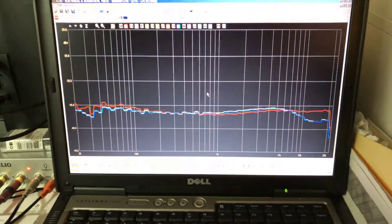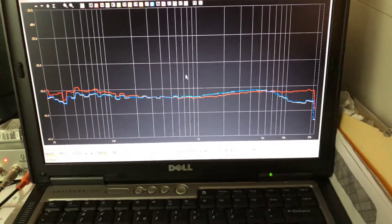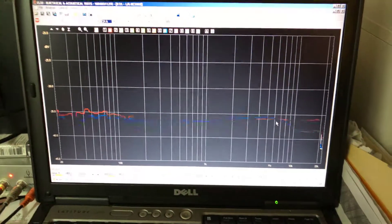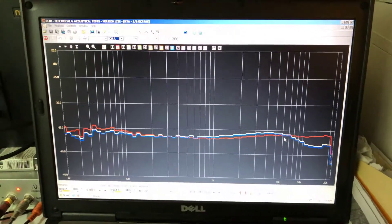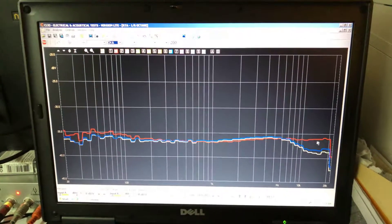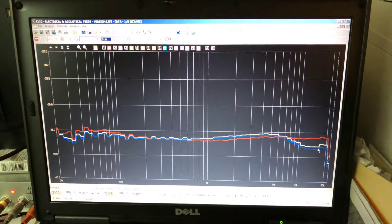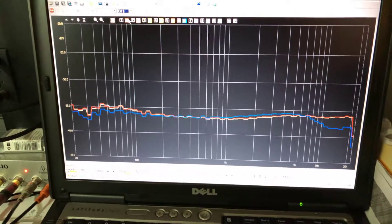With default parameters, pot settings, and everything, it looks much improved just by changing the playback and record heads. You can also see the swing on that channel as the averaging continues — this may be due to a faulty capacitor or noisy transistor that I need to check in depth. I'm pretty happy with one channel; the other channel shouldn't swing this much — it should stay solid like the first.